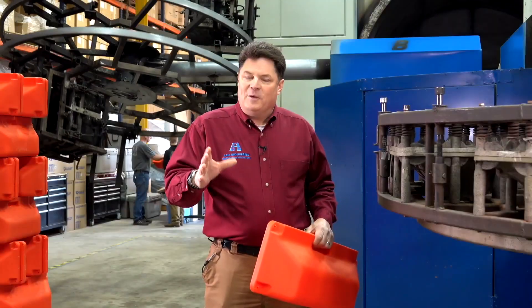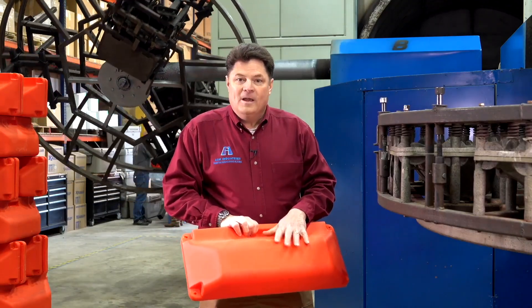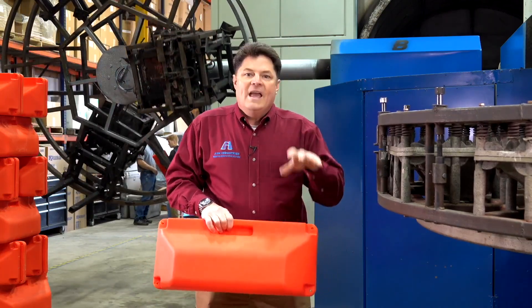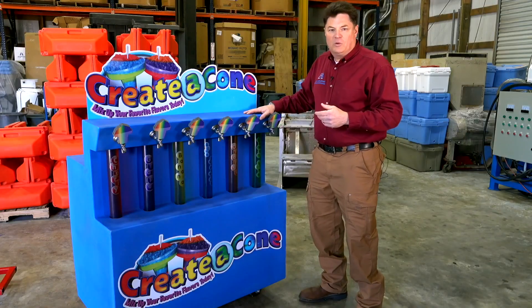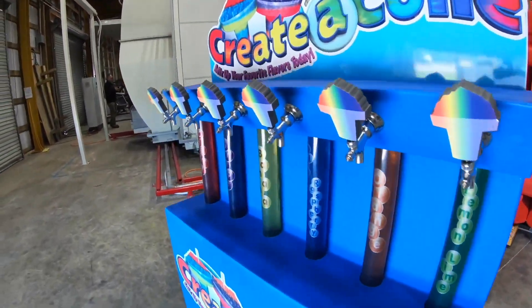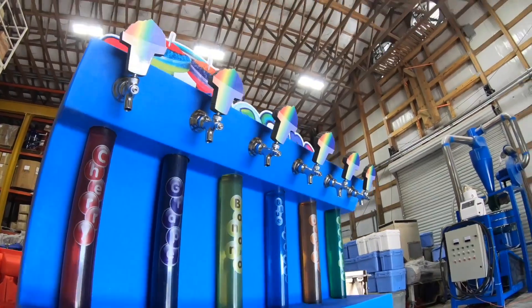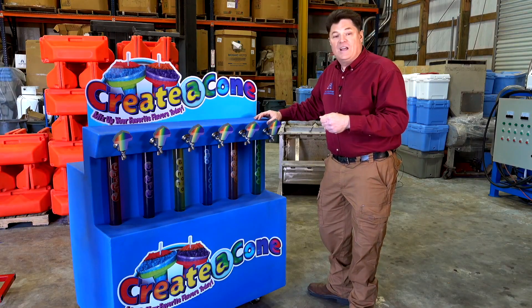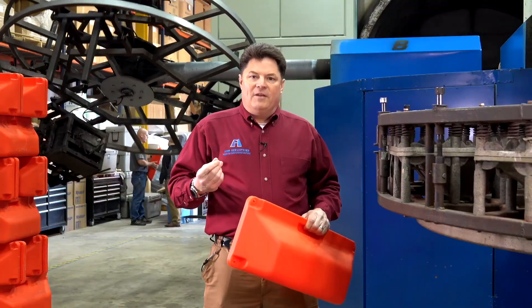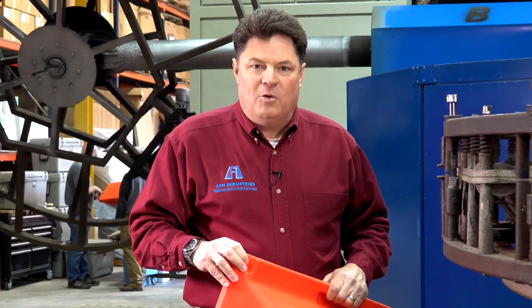Don't forget that we have five other manufacturing groups and can add to this rotational molded part the injection molded components that will make it work. In one case, we have a rotational molding customer that was desperately in need of many different processes. They needed a rotational molded part that was foamed and then would have to be machined afterwards to install electronics. The beauty of rotational molding is that we can make an entire unit in one piece — something hollow in which you can put components, wires, electronics, and other gadgets inside the part. This is certainly less expensive than making a whole cart out of stainless steel. The material costs are lower, the manufacturing time is quicker, and it will never dent, rust, or deteriorate. In one stop, they have the advantage of the engineering, injection molded components, additional machining work, and the foaming capability.